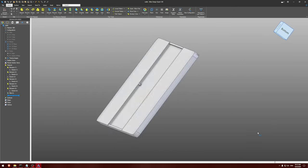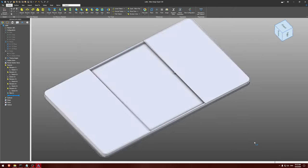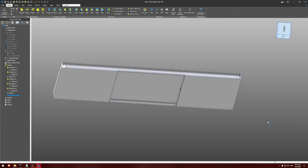I got to work in CAD designing a wallet, which seems like something very weird to design in traditional CAD software. My first prototype was all wrong. I designed it just like I'd design any other 3D print — a regular storage solution with compartments and slots and everything precisely measured. The only problem is that TPU really wouldn't be able to do the bridges necessary for that kind of a design. I proceeded anyway, and on top of the TPU not being up for the task, I also noticed a new problem: the walls of what I had designed — basically a flat rectangular prism with cubbies in it — would not fold up properly either. I had the completely wrong mindset.